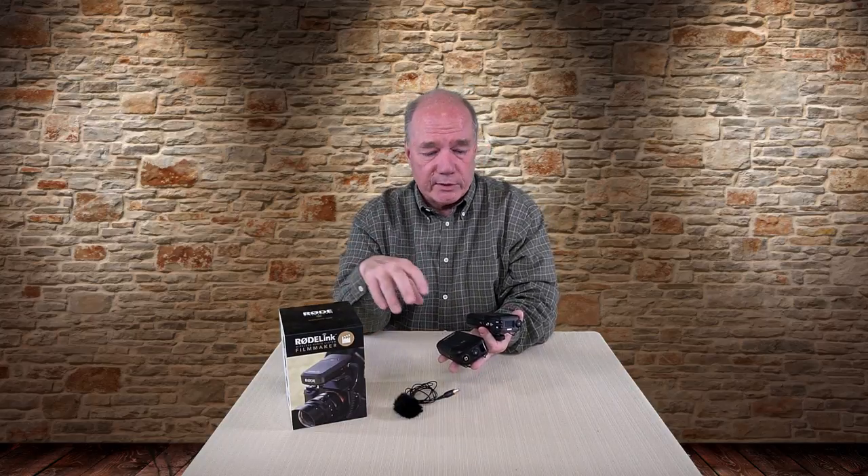The first pro: power flexibility. Every wireless system drinks electricity. I love that there are two micro USB connections allowing me to power from an external source — a wall charger or a portable battery bank, which I always carry fully charged. If I'm recording for a long period and the batteries are getting low, I just plug into a battery bank and record for hours. Even sophisticated systems often use proprietary batteries. This one accepts standard inexpensive batteries, rechargeables, or external power — a really nice touch.